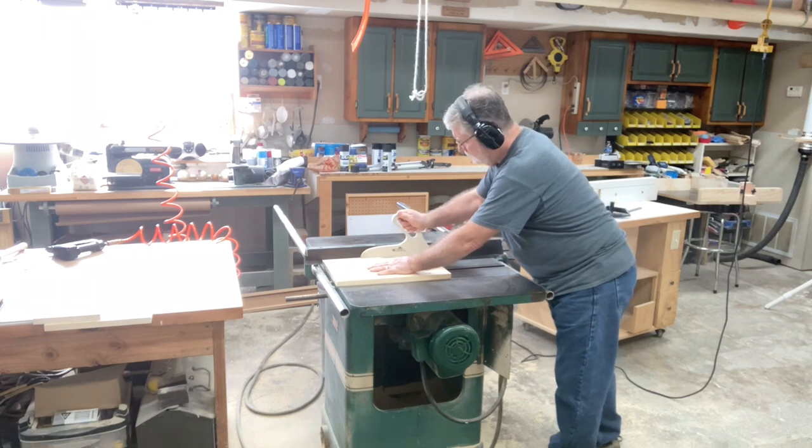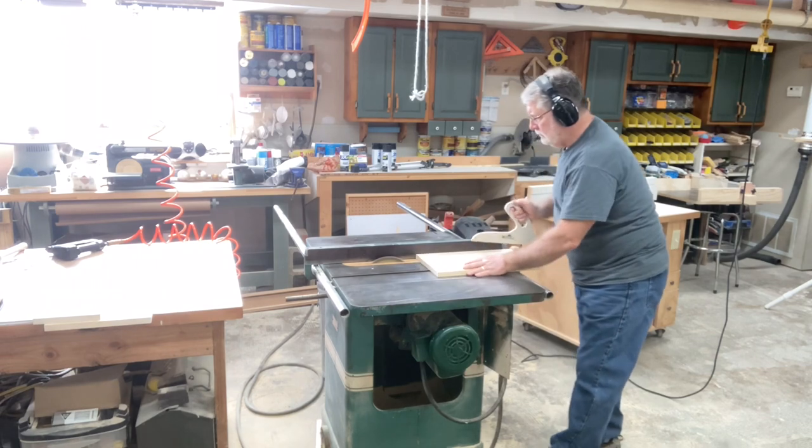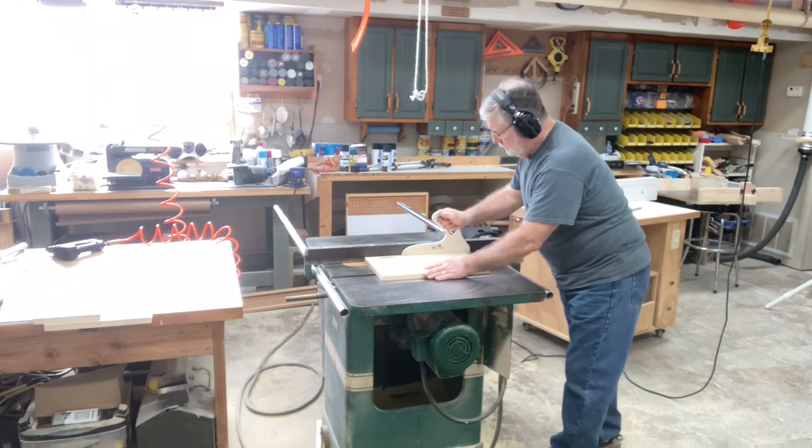The next part of this cabinet is important. The person I'm building this for wanted the American flag on top of the cabinet. We talked about a lot of different options — lasering the flag or different types of flags — and it turned out I'm actually going to make the whole top the American flag, just bordered with the black of the cabinet itself. So the next step is to go ahead and make the American flag. To begin with, it's time to cut out all of the stripes — they're going to be 1 inch wide and 24 and a half inches long.